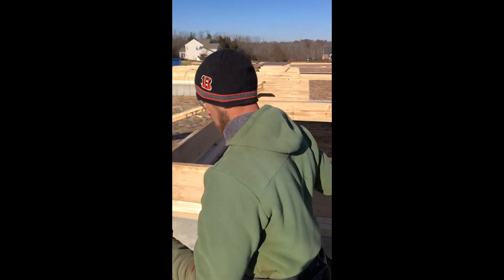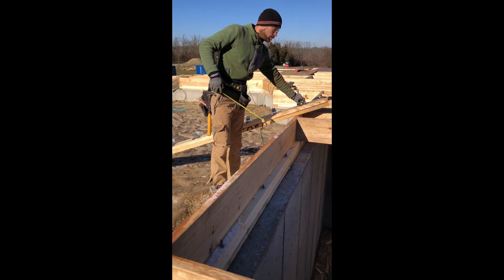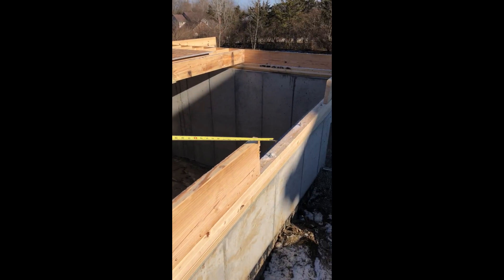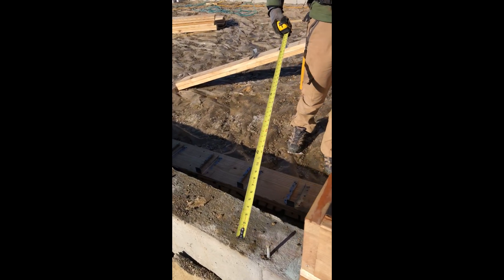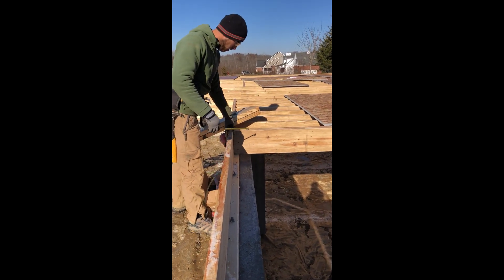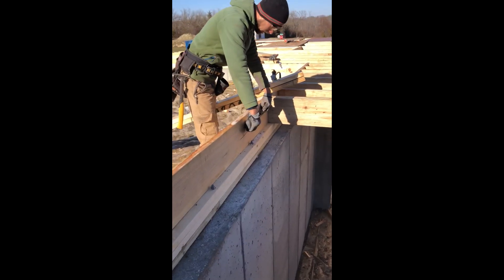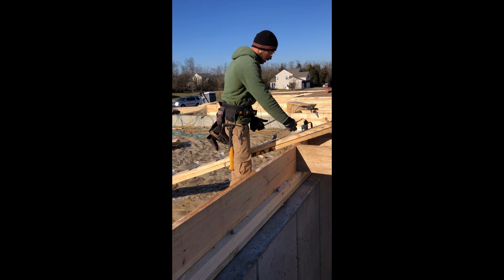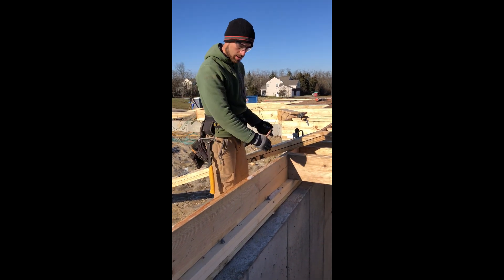We also have some pre-cut joists. It's a double joist, and the joist anchors are set so it's going to run from here all the way there, passing two feet in this direction — same as the other side. I measured from this side of the double to my joist mark, so I got nine inches here, and I transferred my mark onto my double joist. Then I just followed the level layout — my blueprint says in our case we have 12 inches on center in this area.